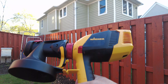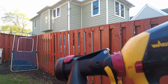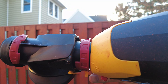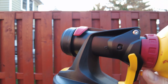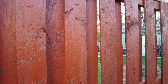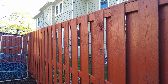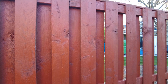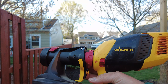Let's talk about this sprayer a little bit. Overall I thought it did really well. It took some time to get used to making the adjustments — figuring out how much to apply, the width, and basically the tempo you're going at. That was probably one of the more difficult things: how fast I was going up and down. I probably wasted a lot more stain at the beginning with a lot of dripping just because I didn't know the pace I should go at, but it got better as it went along.